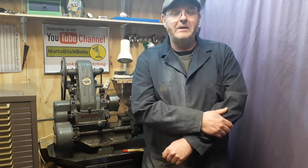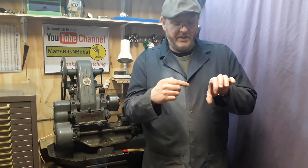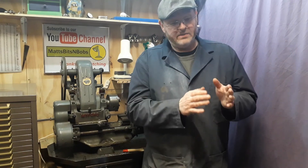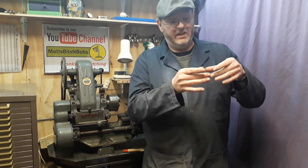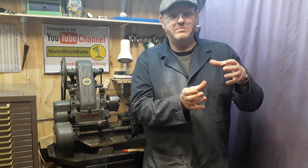A big job done! Key tips: finishing the covers using the cylinder as the jig with 7BA bolts; using the bore itself to centre every operation once the bore is machined; the easy way of drilling the 14-degree steam passages using a magnetic angle finder and two parallels in the vice to clamp across the flat. Simple, using what you've got. Thank you for watching — please like and subscribe, and until next time!